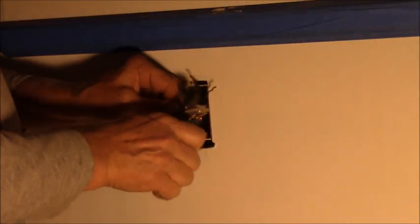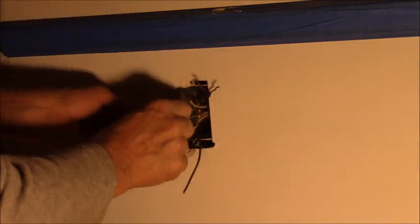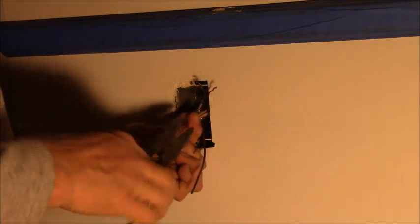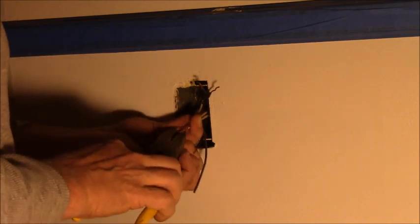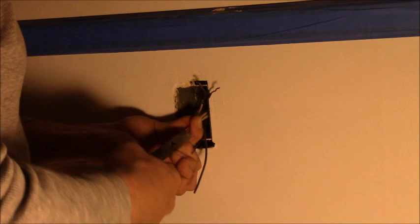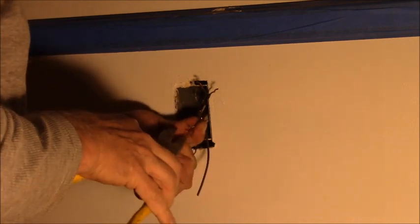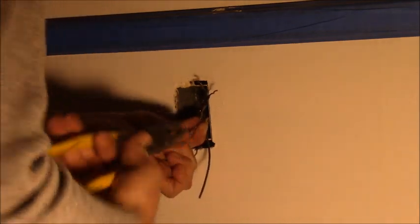In my mind, you want wires touching wires, twisted tightly together, and then your wire nut actually has a spring inside that is tapered. And the wire nut bodies, the new ones, are actually flexible, rubber-like. So what happens is they kind of expand and slide over the bundle of wires, creating a lot of squeezing force too. And therefore, let's see, I got my wires all lined up here, and I'm gonna twist them together just like that. Now I could leave these for good and they'd never be a problem. I'm gonna cut the nubs off the end.